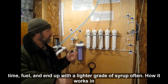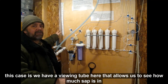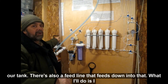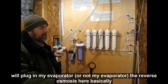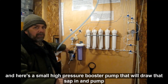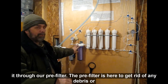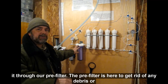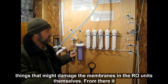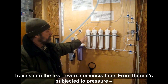How it works in this case: we have a viewing tube here that allows us to see how much sap is in our tank. There's also a feed line that feeds down into that. What I'll do is plug in the reverse osmosis here. Here's a small high pressure booster pump that will draw that sap in and pump it through our pre-filter. The pre-filter is here to get rid of any debris or things that might damage the membranes in the RO units themselves. From there, it travels into the first reverse osmosis tube.